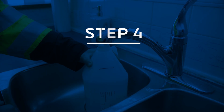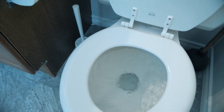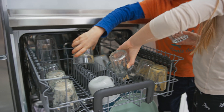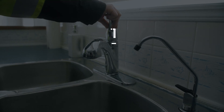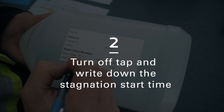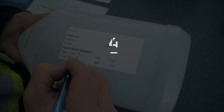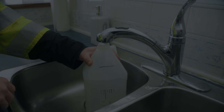Now that we've selected a cold water tap, let's move on to collecting a water sample and completing your water sample form. Before we collect the sample, it's important to note that we require a 30-minute period of no water usage in the home — this is called the stagnation period. That means no other taps in the home should be used during this period, no flushing of toilets, no doing laundry, or using the dishwasher. Make sure you communicate this with your household members. Here's a quick overview: we'll begin with a five-minute flush of the cold water tap, write down the stagnation period start time, follow with the 30-minute stagnation period, write down the stagnation end time, and then collect the water sample.